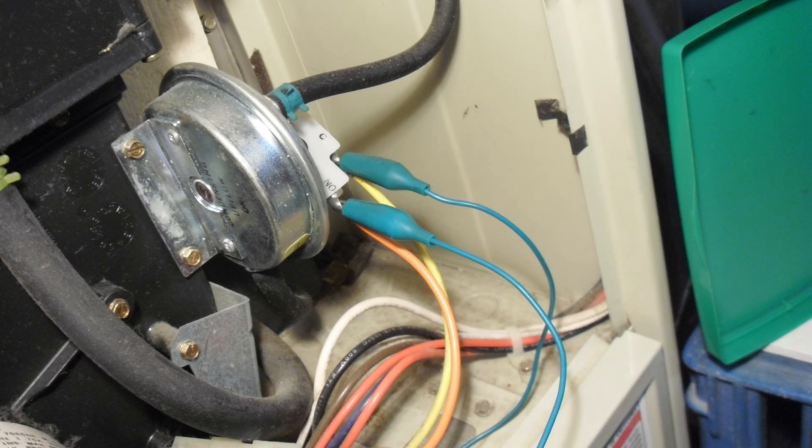To see if this works, turn your power back on, let the furnace cycle, and now see if the igniter lights, and when it clicks and calls for gas, the gas comes on and your furnace is working. If not, we'll have to try something else. If it has, you can use your furnace now and watch it to see if it continues to work, but you still should try to make a more permanent fix. If the igniter goes out and the furnace never called for gas, we'll start over again.